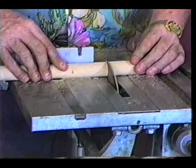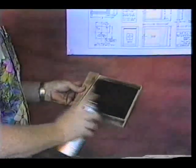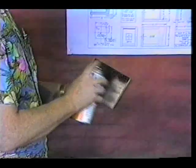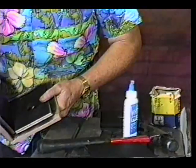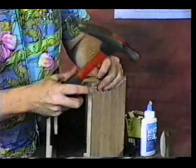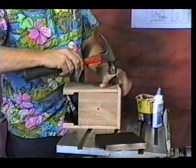What we're cutting here is the shutter — and there's the clamp. We're making some final sandings to the wood just to make sure everything is smooth and nice. Knocking off all the rough edges, and now we're going to paint the inside of the camera. It's easier to paint it now, and if the wood is painted over the edges a little bit it just helps with the light trapping, makes sure everything is light tight, and you get a good coat on the wood. The wood dowel now has to be fastened in — make sure it's also painted black. At this point we're making the assembly. The black is dry and we're just putting the camera together. We use white wood glue or any type of wood glue — casein glue — and then we just nail it together. The joints all interlock and form a light lock to the camera.